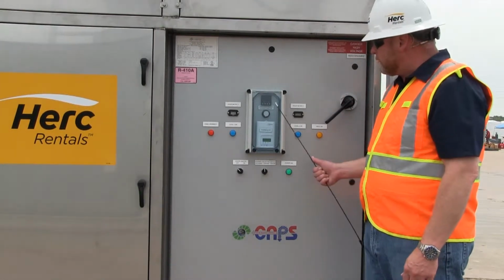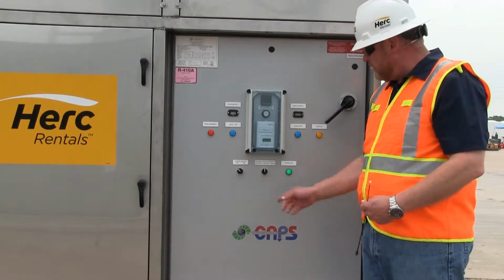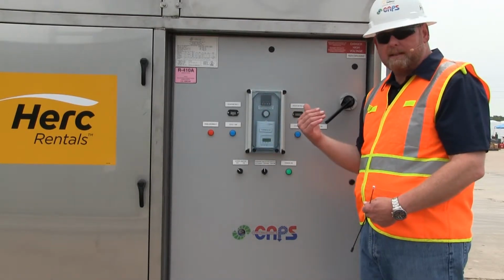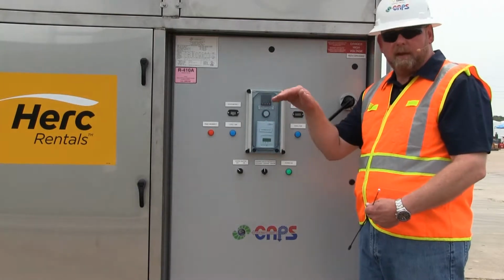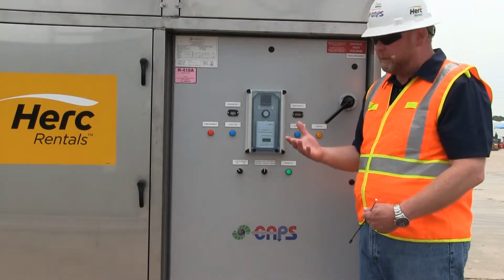Leaving air, there's a special controller here, and I'll go over it, called the 60-40 controller. You put it in leaving air, which is where we would have it right now because we're taking in 100% outside air. And leaving air, that control varies the VFD of the evaporator fan to get to a desired set point of, say, 55 degrees.